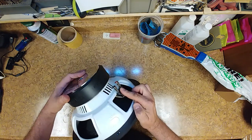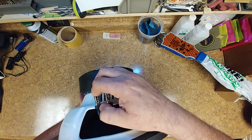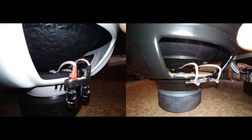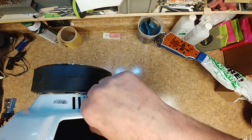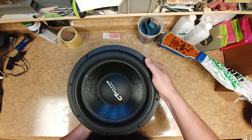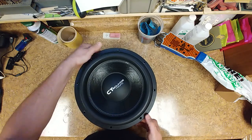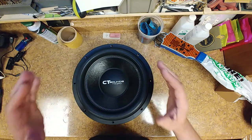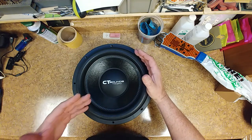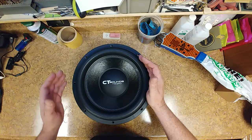Another thing is the terminals — these are 12-gauge wire push-in terminals. You push them down and put your wire inside. Also, the leads are laced into the spider. What's inside of here is called a spider, and I think it's double-layered. It's pretty stiff — you really can't push on it very well. And this driver here, you're not really moving it by hand very far. It's kind of tight. So overall, with this driver I'm going to be able to push 500 watts into it, maybe a little bit more, at 2 ohms, after I change the wiring inside the enclosure to suit this driver.